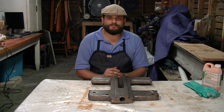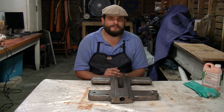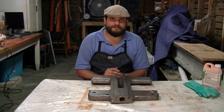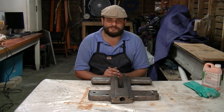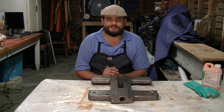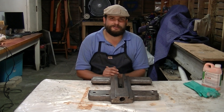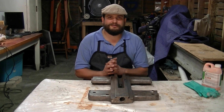As I was working on the saddle, removing the paint and years of paint and rust and grime, I began to notice that the saddle had basically been used as an anvil. Someone at some point had this lathe and they were working on parts and needed something to beat on, so they beat on the lathe on top of the saddle and the cross slide and basically everything on top — except for the ways. Thankfully, they did not beat on the ways.